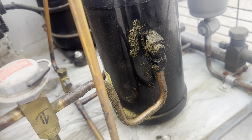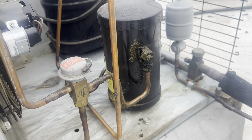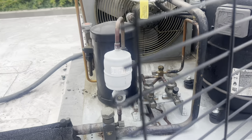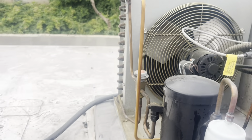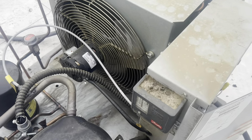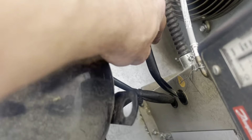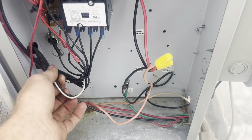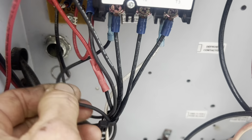It's not running currently, but assuming it's short again, we'll see. I wanted to come up here and put a leak test to everything. I took the top off and started getting a little bit of hits over here. I wondered if it wasn't rubbing out coming through here, but I don't see it. The only place we have what looks like oil residue — so it's definitely oil residue on that. I'm guessing we're leaking from the flare. I'm going to get a rag, clean all this up, and see what we can find.